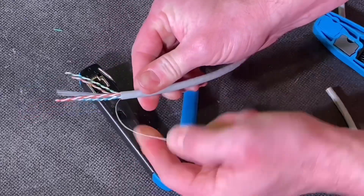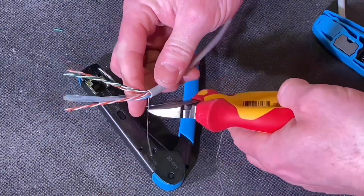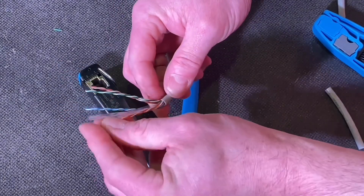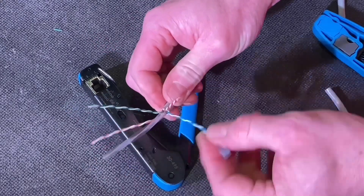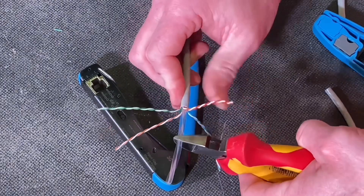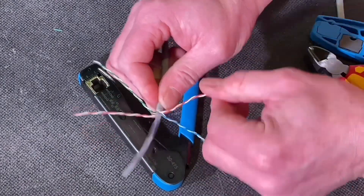The little string here can be used to pull down the side of the cable in order to lengthen it — I don't need it so I'm just going to lose that, just cut that off. Then I'm going to part my conductors so I can remove the center piece of PVC. I just move those out of the way and give it a little tug to pull it up a fraction, then fold the conductors out of the way.